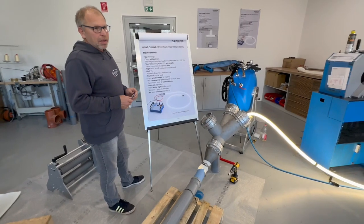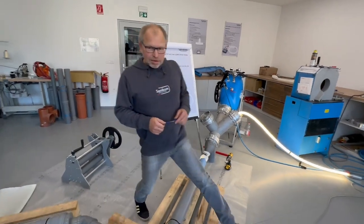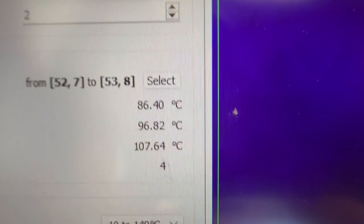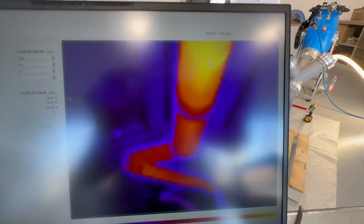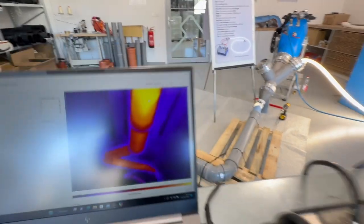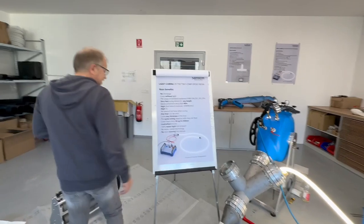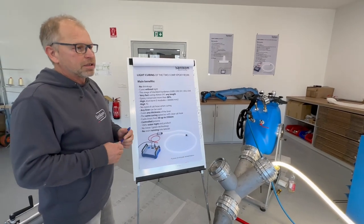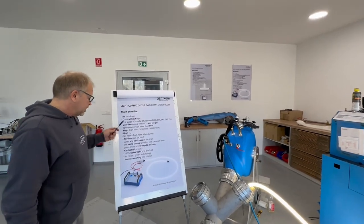I know the question will come up if you want to do open end liner. Stefan, we already have more than 100 degrees, let's check. Just to show you, 19 minutes. In 19 minutes, we have a full reaction, that means a full exotherm reaction. We have more than 100 degrees, so you see it's already in the end stadium of curing, but still we have to wait until it is completely cured, so these 40 minutes are perfect. So we go on here.